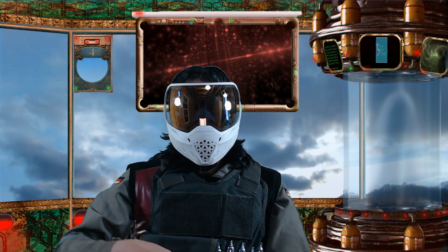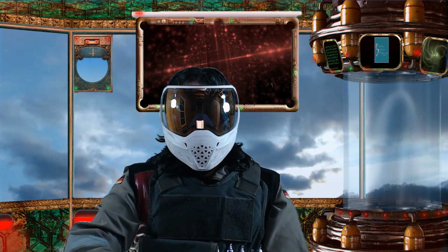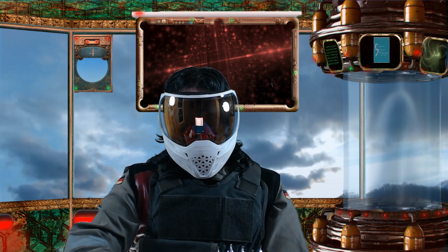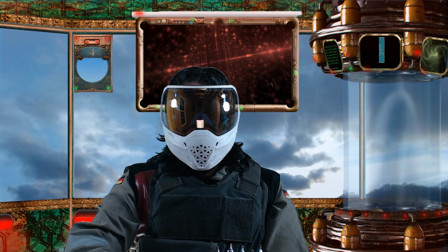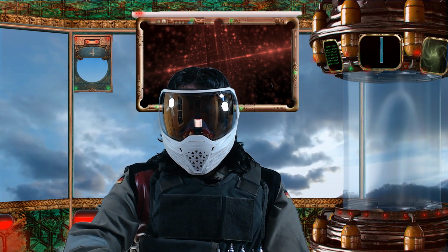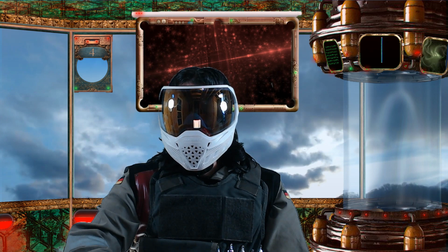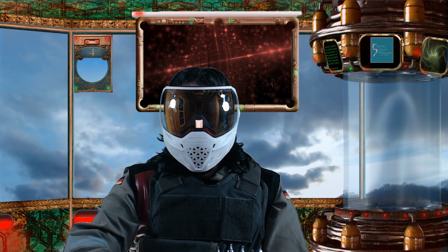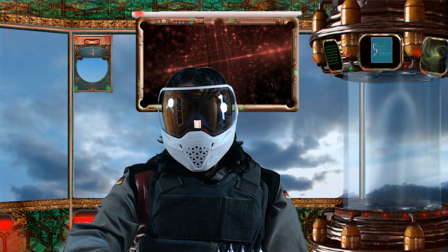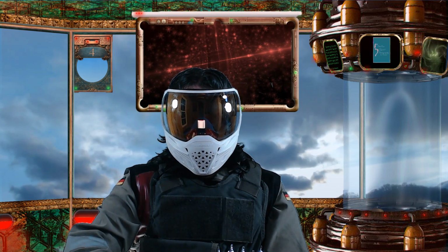The balloon itself is filled and encased in a cardboard sleeve. This is in turn wrapped in paper towels and rubber banded together. This is not just a protective balloon, but it is in fact required to launch it. As you'll see in the video, 3 sheets of paper towel are crumpled up and wrapped in 2 other sheets. This is then shoved down the barrel, and it is very important that it is as tight as possible. The cardboard sleeve and balloons is then inserted, followed by the other 2 paper towels, crumpled up, of course.